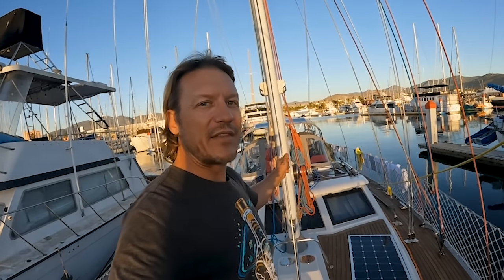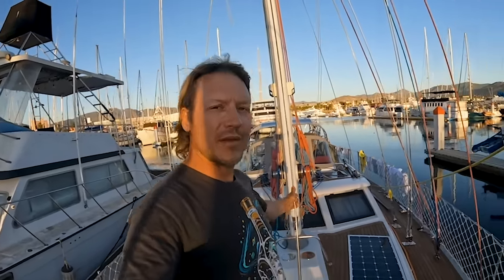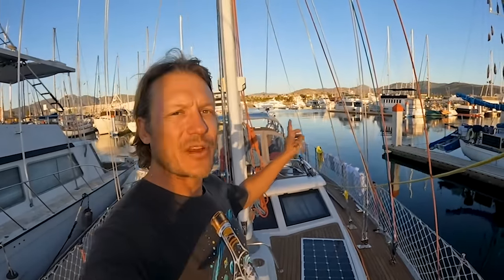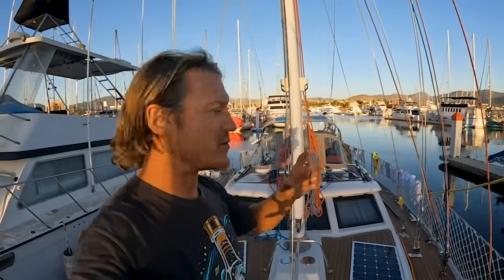So to tune the mast, you get these all finger tight, get the mast loose so it's straight, because the extrusion is going to be straight, so we want it to be straight. Now that it's straight, you make all the base hand tight, and then you pull out the baby stay, and you count the revolutions on both the side stays. You know that they're the same length, so you just measure. You can count the threads, or you can just count how many revolutions you're doing.